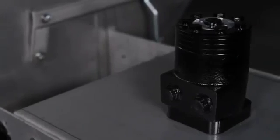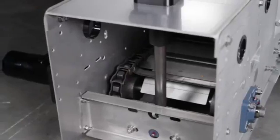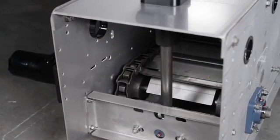So it's a truck-driven PTO that supplies oil from the pump to the dual hydraulic motors, one spinner motor and one conveyor motor. Simple, easy, no maintenance, truck hydraulic driven. It's controlled with a valve that's supplied by Torwell in the truck. It's mounted in the truck, and it controls spinner speed and conveyor speed on and off.